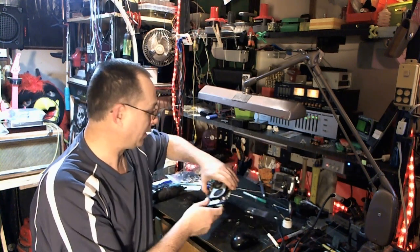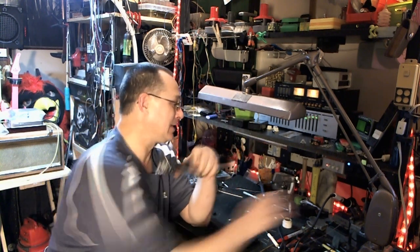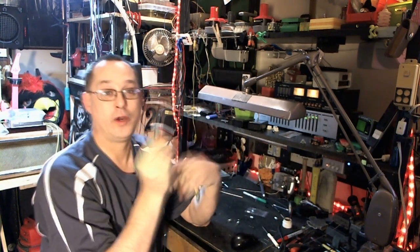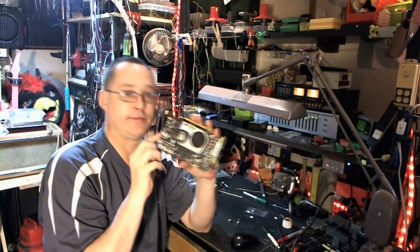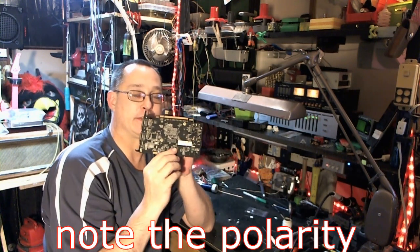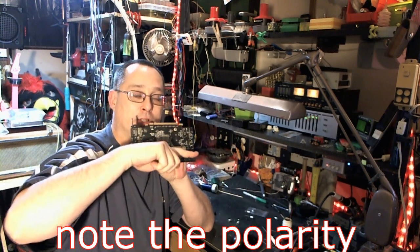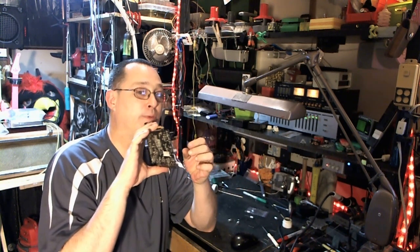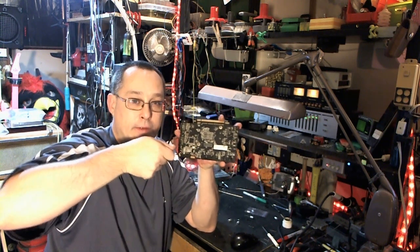The actual replacement isn't that difficult. I used a higher wattage iron — a 40-watt. What you do is locate the failed part, flip it over on the back, and you'll see two little pins sticking out with small solder points on them. I laid the soldering iron so it was touching both of those points at the same time, while applying reverse pressure pulling away from the board.